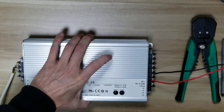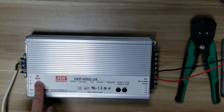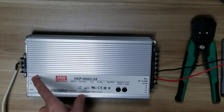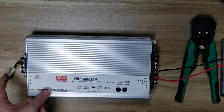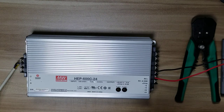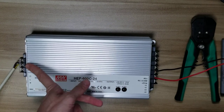For your AC-DC power supply, you're going to connect your line and your neutral. You've got your ground, line, and neutral over here on the AC side. Put your cover plate on for protecting your fingers from the AC power — that's the dangerous stuff. Get an electrician to connect this side up.